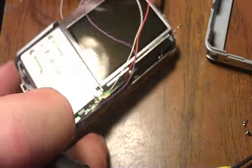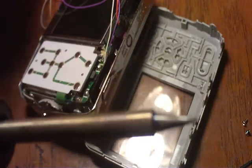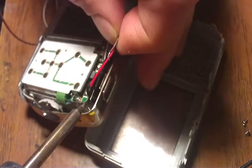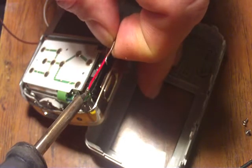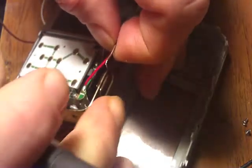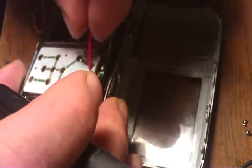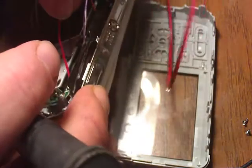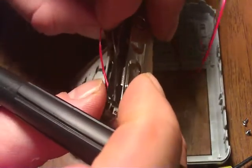I want to use a little heavier wire for this because this is my battery voltage and I want to be able to charge and use externals. I'm going to lay my wire on there and solder that one. Then my negative or common, which I'm going to use for both my external — I'll try to get this thing in position here to solder.